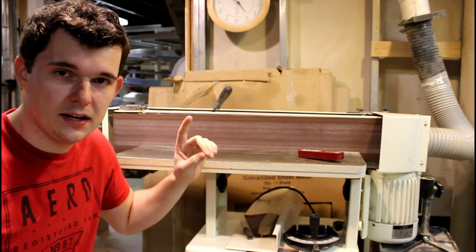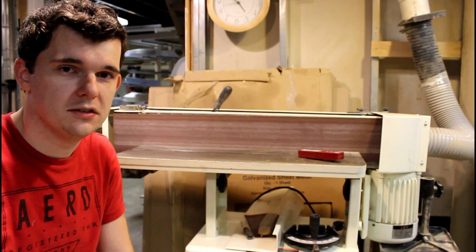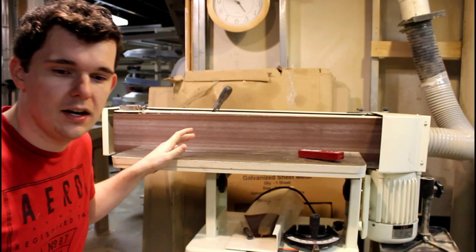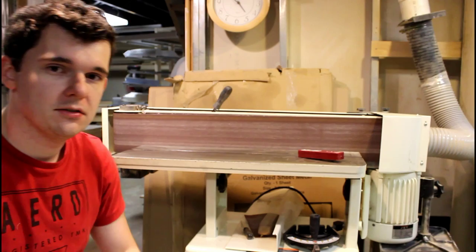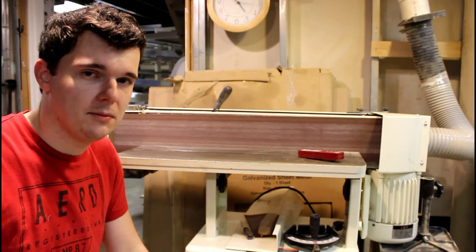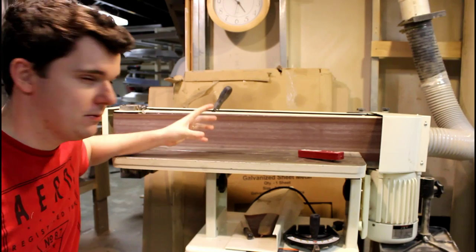This has a 1.5 horsepower induction motor — a TEFC, or totally enclosed fan-cooled motor. It's pre-wired at 115 volts and can also be wired at 230. It has a 10 by 30 inch table, and a 6 by 89 inch belt on the back which is a common size — nothing proprietary, so you can buy it from multiple vendors, which is great. It also comes with a miter gauge and some accessories. The machine is 270 pounds, which works great for absorbing vibrations. I've installed a mobile base on the bottom and I suggest you do the same — obviously it lets you move this around the shop, but there are also a couple of cumbersome things about this machine where having it on a mobile base makes your life a lot easier.